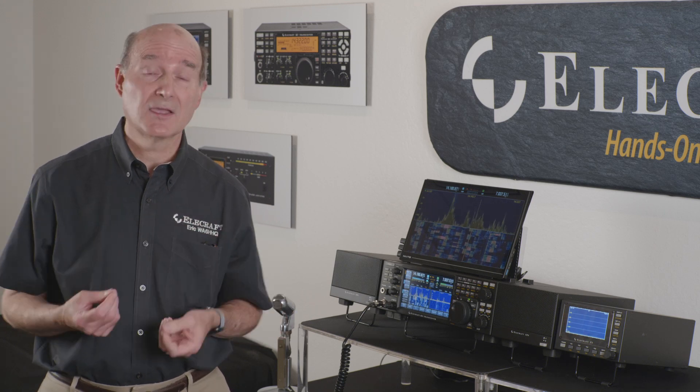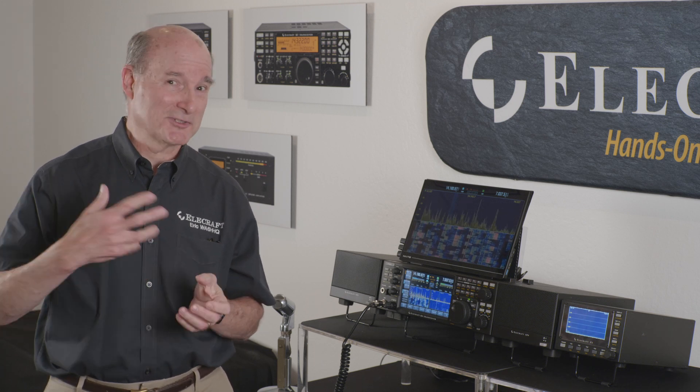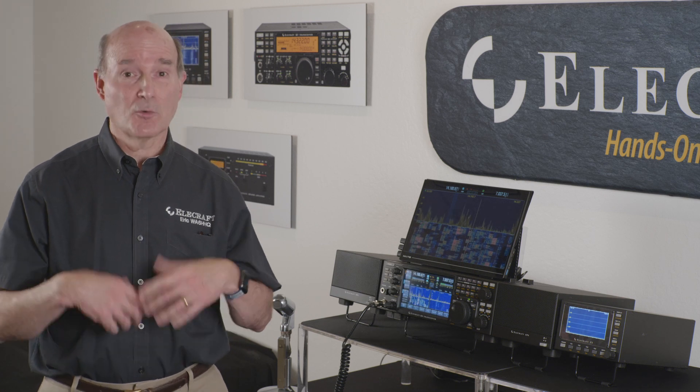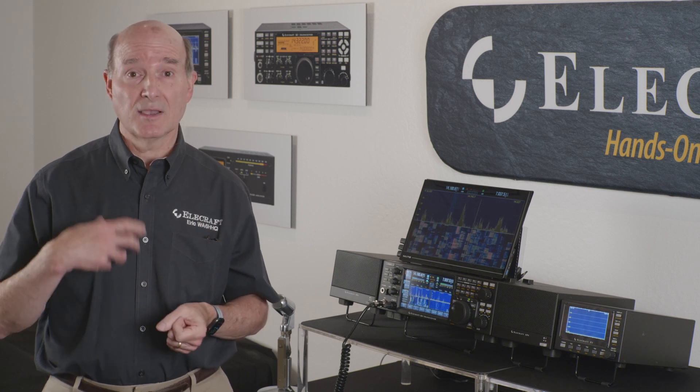The last feature I'd like to talk about is a highly requested feature — audio recording and playback off the air — which we're adding hopefully in the R29 release. By pushing and holding the AF record button, you can record off the air. Then pushing the AF play button brings up a dialogue on the screen where you can pick whether to play back the main VFO or the sub VFO and pick which sections to play back. This gives flexibility to replay something you weren't quite sure you heard correctly — such as your call sign during a DX contact — or to record friends off the air so they can hear how they sound at your end.